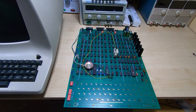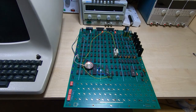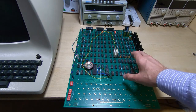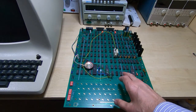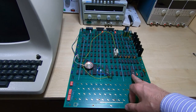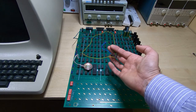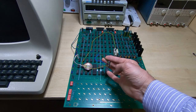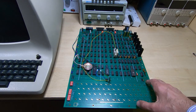This is part 18 in a series of videos in which I am producing a reproduction of an ADM3A dumb terminal main PCB. I've got it as far as now being fully tested and it all seems to work the way it should. The only real changes I've made to the design from the original are fitting a more modern EEPROM for the character set and fitting an extra socket to connect a monitor more easily.